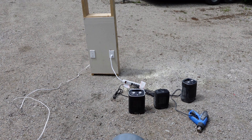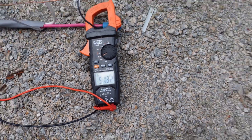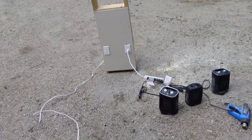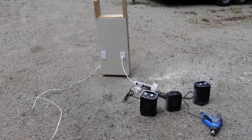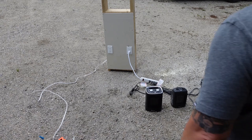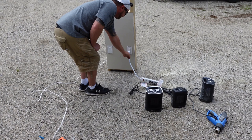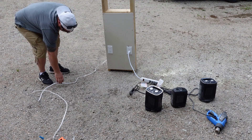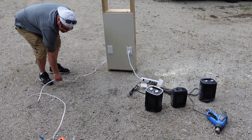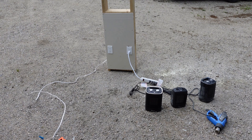The extension cord really wasn't that impressive, so now we've got a power bar from a cheap dollar store. This time I'm pulling 51 amps — I added a heater along with the heat gun, so we have three heaters and a heat gun, well beyond what the circuit should be pulling. The cord is getting kind of hot and the plugs are hot too. I can feel the heat coming out of them, and the 14-2 wire feels gooey — we're pretty close.